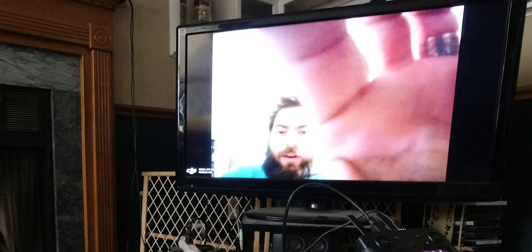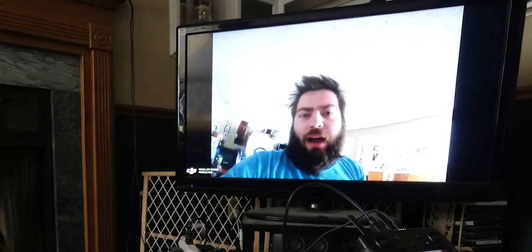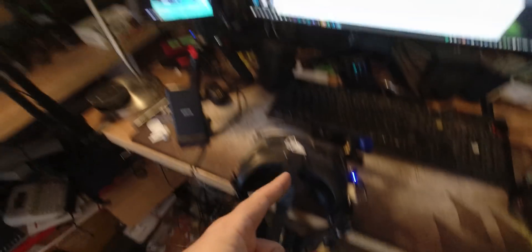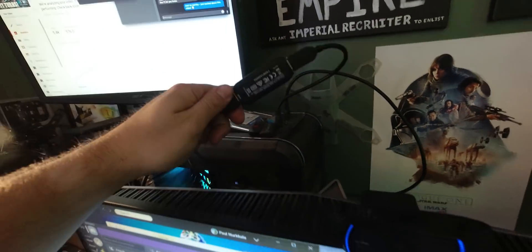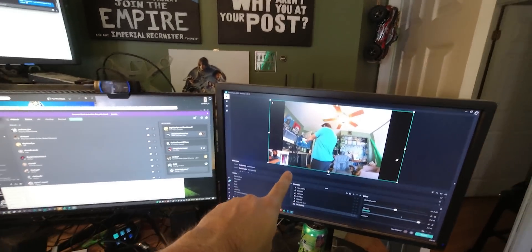It's pretty insane that we can finally push this video out via HDMI to do whatever we want with it — hook it up to a TV, do a live stream, all that stuff. I'm really excited about the possibilities. One of the things I'm most excited about is that I can now take the feed from the quad, run it through the goggles into the smart controller, through an HDMI cable into this Elgato Cam Link 4K — which is an HDMI capture card — into USB, and now my computer receives that drone as a webcam, giving me the ability to stream in 1080p or 720p live.